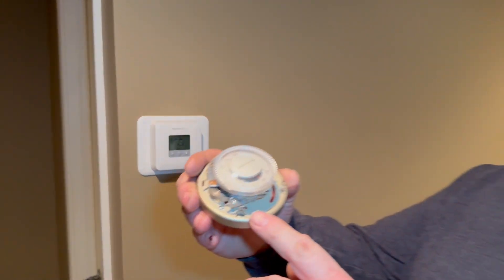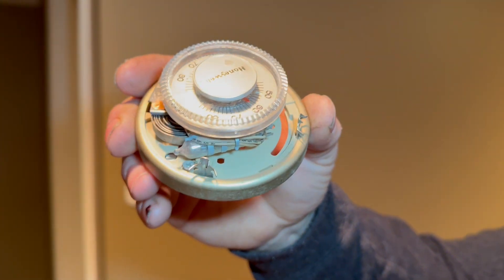We got that thermostat installed — it's a nice-looking digital thermostat compared to the old analog one, and a lot more precise. I also wanted to mention: with the old thermostat you can see inside this vial that it actually has mercury in it. You can't just throw these in the garbage; you've got to dispose of them properly — take it to your local heating and cooling company or to Home Depot and they can handle it. I'll link another video on how to work on the boiler and install a boiler pump, and another video on zone valves. If you found this helpful, please like and subscribe — have a great day and you've got this!